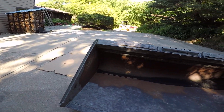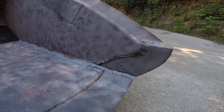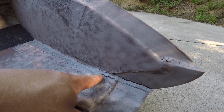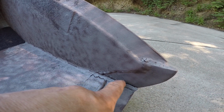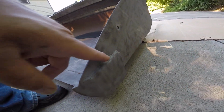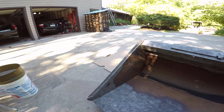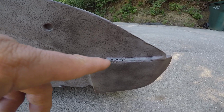The reason I think that is, well, you can see it's been blown out. It's got a crack in there, and this weld's garbage and blown out. I'm gonna work on that, get that fixed up. I think these blocks have been replaced because these welds don't look like something a factory worker would do. Like this one, the porosity on that, I don't believe that would pass.